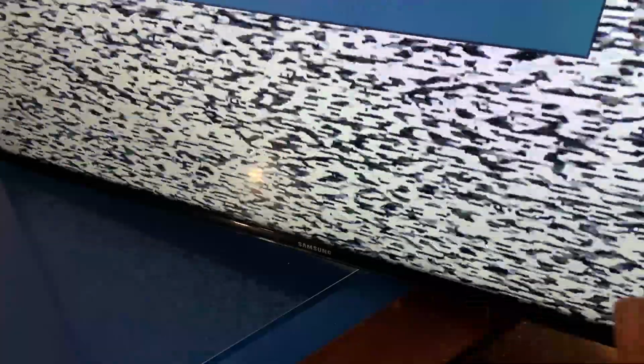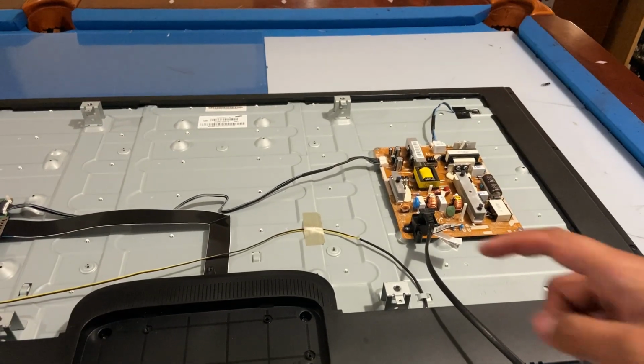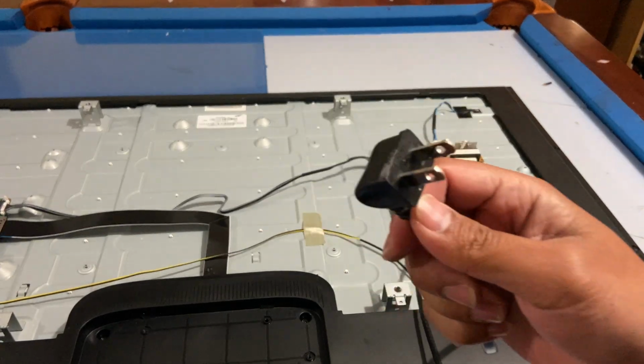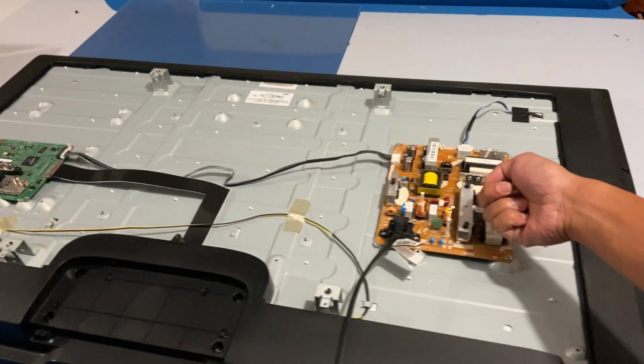And what I'll do is, after turning it on for 5 minutes, or in the case of this video, I'll check the temperature of the component that I just put in. So I'll touch the, be sure to unplug it first and then touch the heatsink first, and then the component. So now I'm touching the MOSFET here.